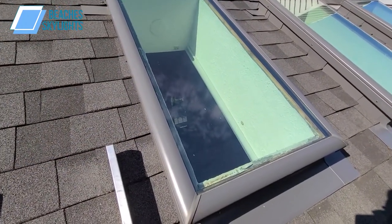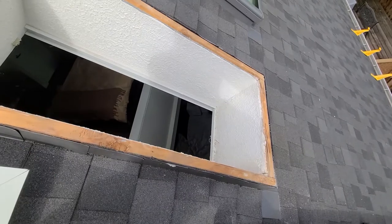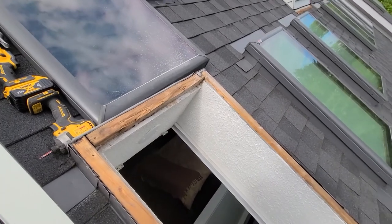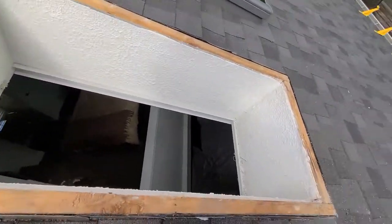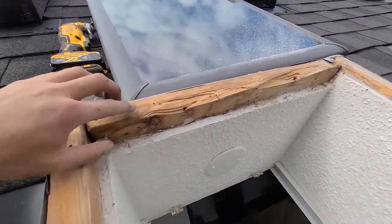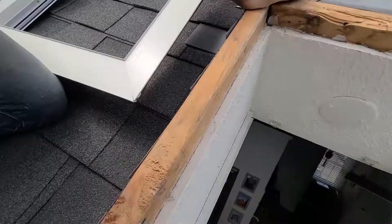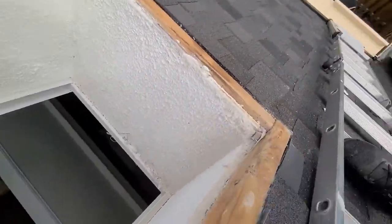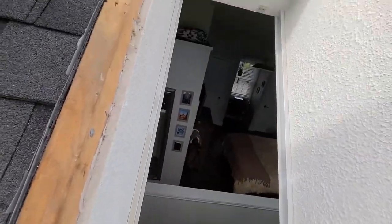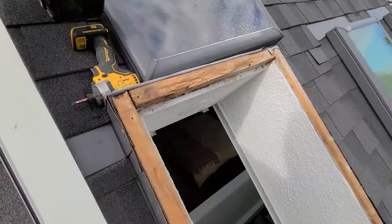Make sure our blind is going to fit. So the next thing I'm going to do is pop off the skylight. Alright guys, got the skylight popped off and we're just about ready to put in the blind. Just wanted to show you what I did to make it fit — in this case I had to cut back some drywall, about an inch and three quarters, maybe two inches at most, on two sides. These two sides are staying as existing drywall and the other two sides got cut out.